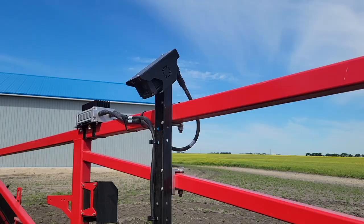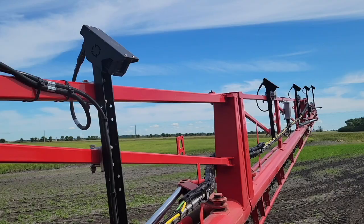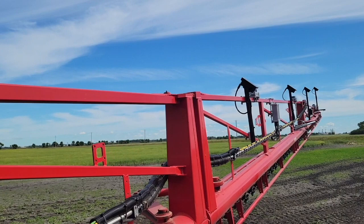Okay. So for those who aren't familiar with green-on-green technology and how these cameras work, can you walk us through the process of how this controls the sprayer and ultimately controls weeds? That's the idea? Yeah. Basically, our camera is like a human eye. And we are looking a few meters in front of the boom. So as a human, if you can spot the weed in a few meters, then our cameras will be able to detect it.